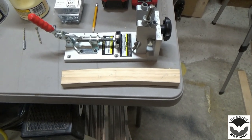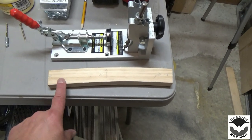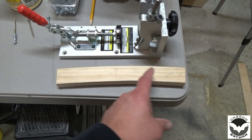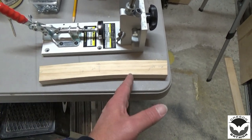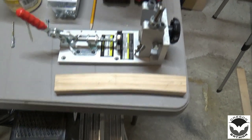Then once our spars are fastened to the wall, then we have our spacer blocks on each side as we follow around the contour of the trailer. We're going to put a pocket hole drill on each side. That is going to fasten into our spars from front to back. We will glue the crap out of that thing.